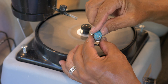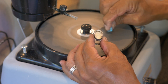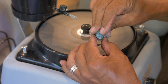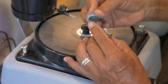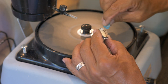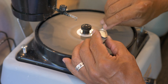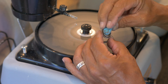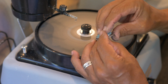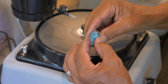I think one final touch and it'll drop right in there. What I'll do is back-bevel this edge a little bit so I have a margin for error, and it'll slide right down into that little bezel setting.